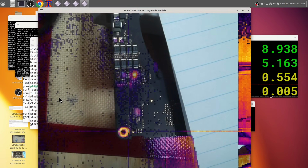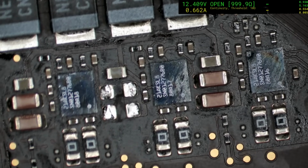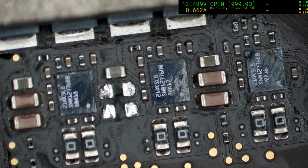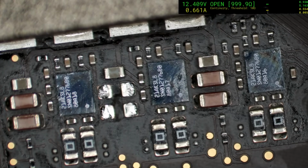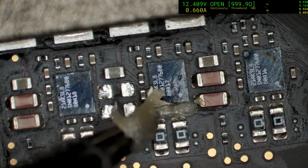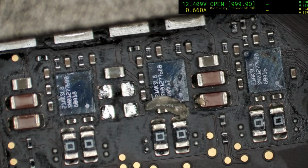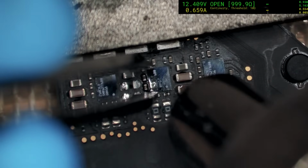It is the controller. Alright, so it's this middle controller. That'll explain why nothing really showed up when we looked at those caps, because it wasn't the caps. To be fair, they were corroded, or they are corroded, so no harm in removing them. But it does explain why the caps seem perfectly good, and another reason why I stopped just pulling caps, because I thought, this doesn't seem quite right. Fortunately, there's absolutely nothing on the other side of this board.